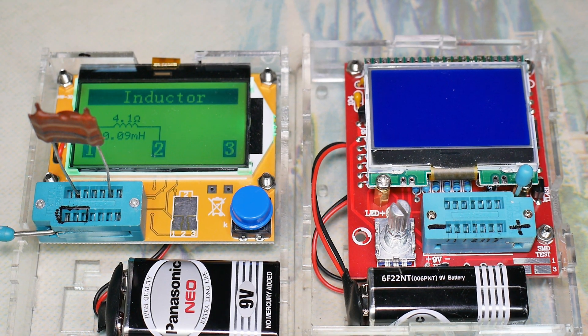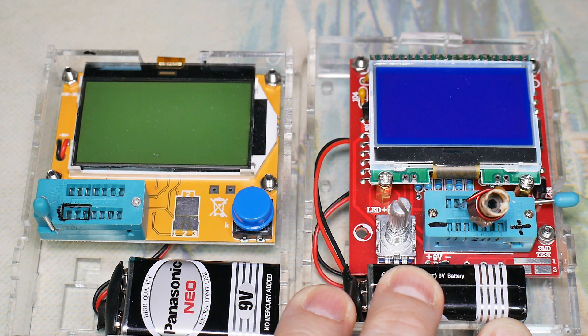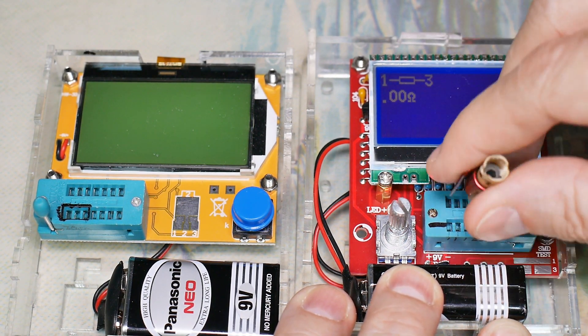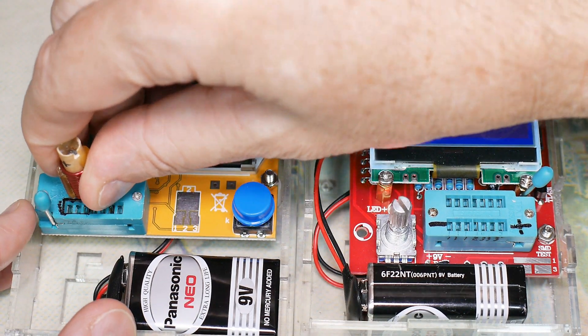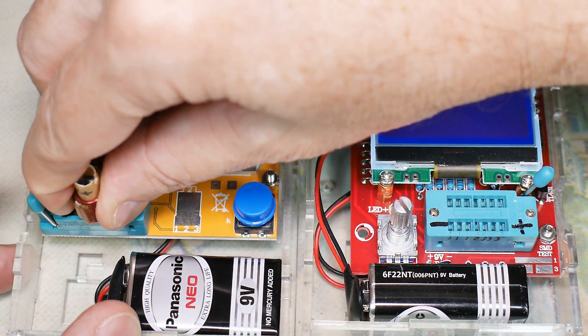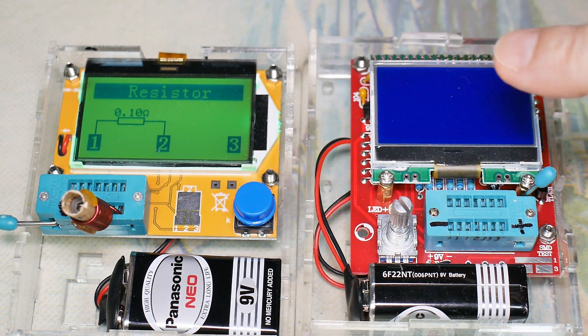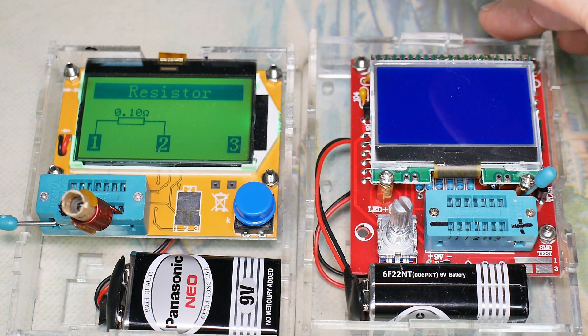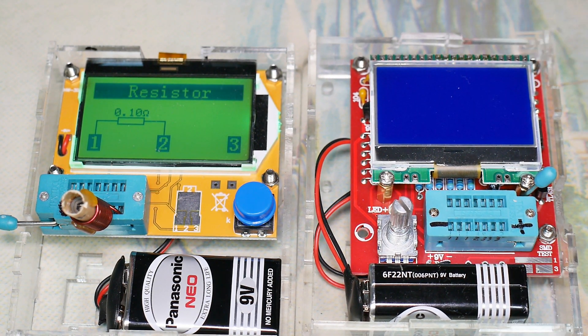Let's try one that fools them almost every time. Here's an inductor that they don't usually do very well with — it has a core, it's a very short coil, and it usually thinks it's a resistor. Yes, it thinks it's a resistor. And I know this one will do the same because it did in the last test — it thought it was a resistor. And yeah, it thinks it's a resistor. The limits on these for inductance isn't good. However, I found online for a few bucks they actually have one of these devices that tests inductors and it seems to have a much wider range, so for the price I think I'll probably get one and test it.